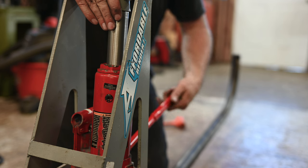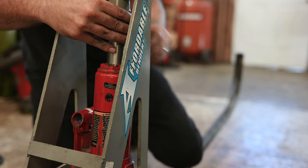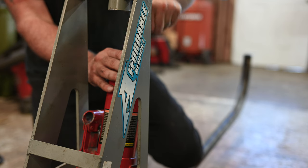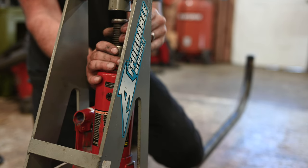Like I said, I have no real experience with tubing benders. I bought this affordable bender used, and I'm finding that you get what you pay for in this case. My biggest gripe with it is that it doesn't seem to be able to bend a full 90 degrees in one go. I have to bend the first 50 degrees or so, then raise the extension screw on the jack to finish the bend. Pretty annoying.